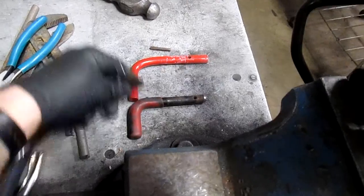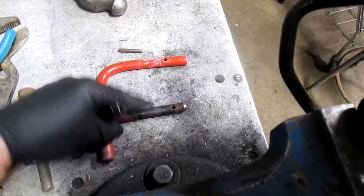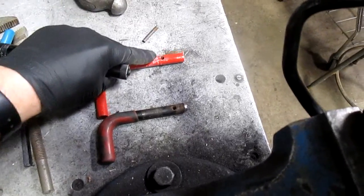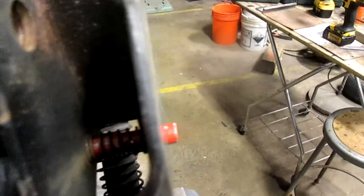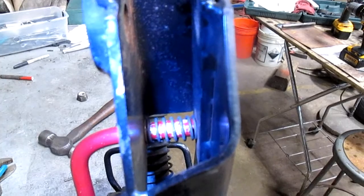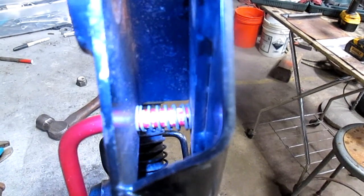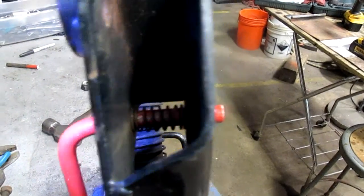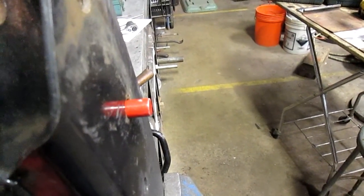You see, that's the old one, and here's the new one that I made. It's just a half inch thick and pretty simple to bend. Then you cut the hole for this roll pin. The roll pin goes on the right side there and goes against the spring right there, so that this pin, when you pull it back, will want to move that way.